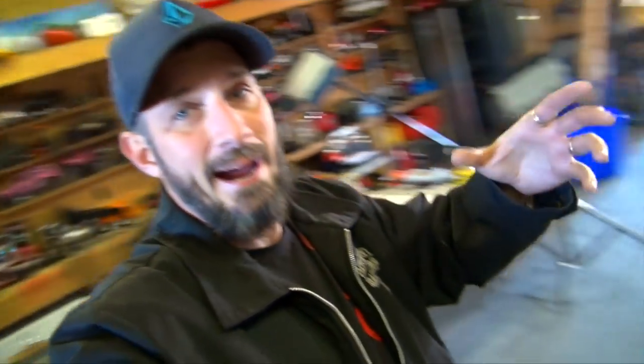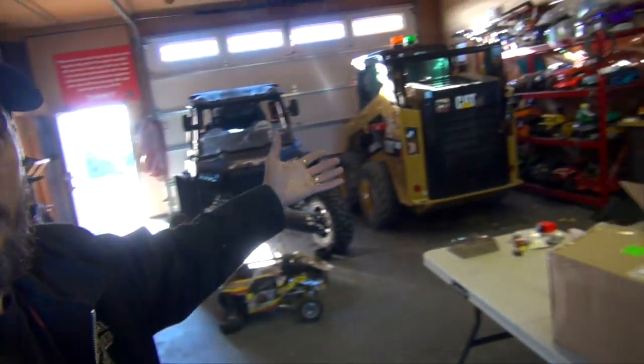We're gonna investigate what's happening and I'm gonna send back the electronics to the manufacturer. The bonus is they have a great support system. I already called them and got them to send me a brand new radio as well as a new brain for the actual robotics that get installed into my loader. It's a big D-series loader from CAT. I've had a communication issue where the radio itself has stopped talking to the machine and it's lost its bind. After troubleshooting everything, we figured there's something wrong with the radio or the main module, so I'm gonna go ahead and swap it out.